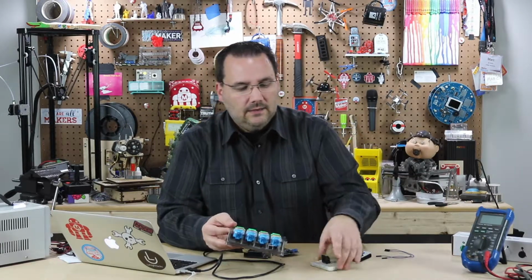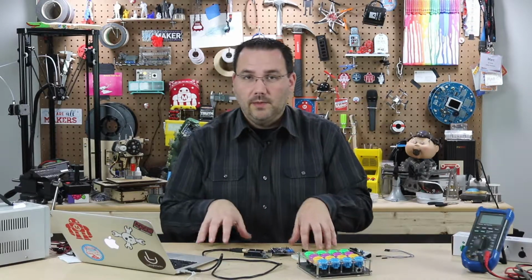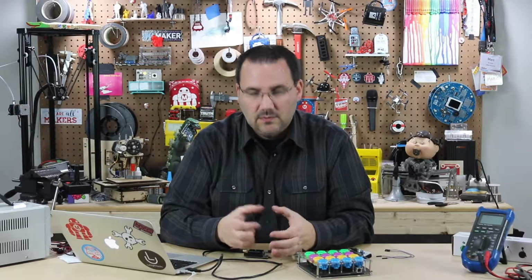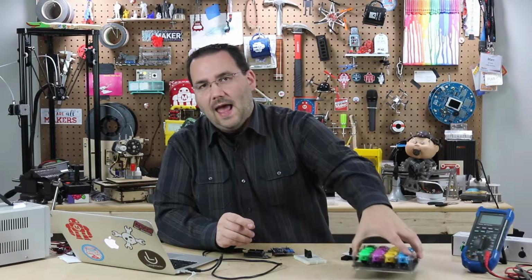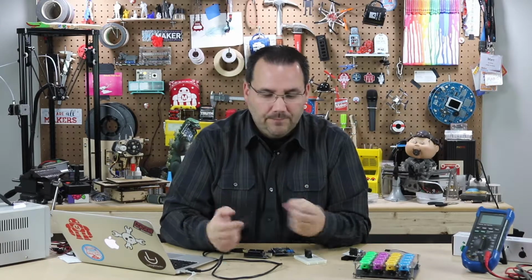And basically it's a communication protocol where it enables you to press a button or be on a keyboard and then have audio being played through a head unit. Your head unit might be a laptop, or it might even be just a small drum machine with some microcontrollers in there that can generate the audio waveform. So we're going to look at MIDI signals out, not necessarily MIDI in.